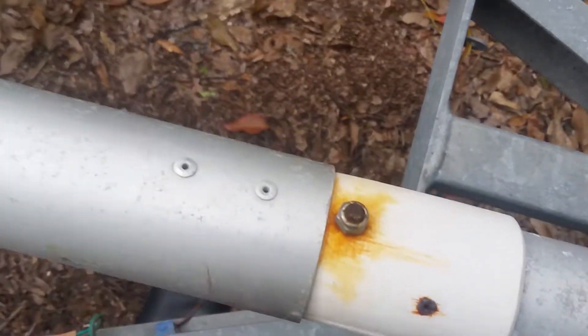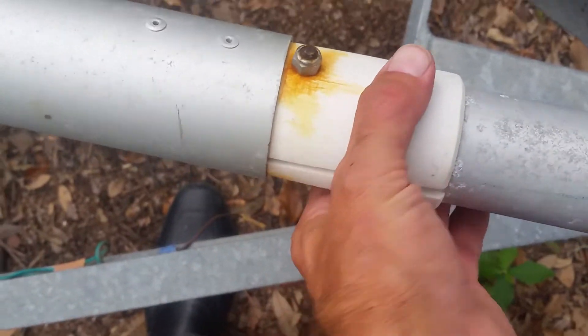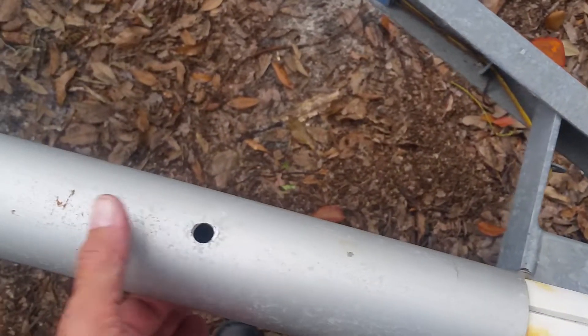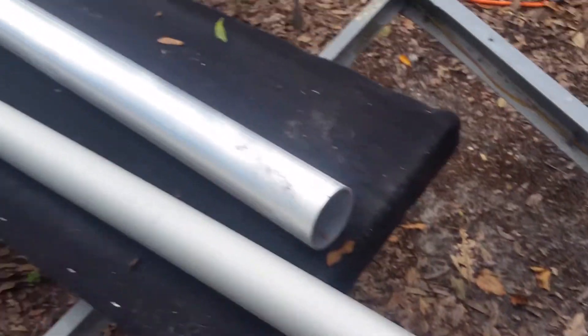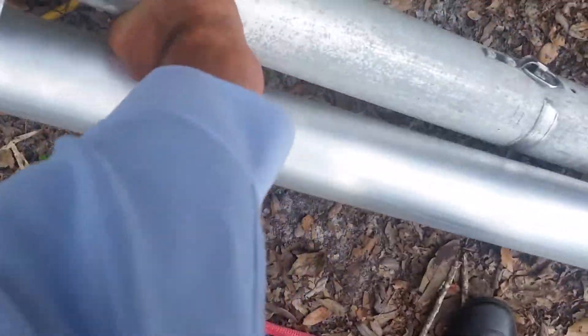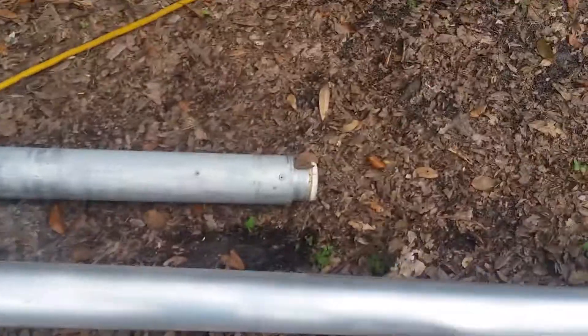Here's the secret of making your own mast — a couple of pop rivets. I'm not sure why that additional piece is there; you can see it is certainly rusted out, but I'm not sure it needed any more than the pop rivets. Here's the top, so once again there's a join up there. Still planning on adding this section. You can see how much longer this is — that's equal to where the current join is, and this is how much I need to add. I'd still be cutting off this section there, and you can see he puts a foot on this section so it'll rotate.